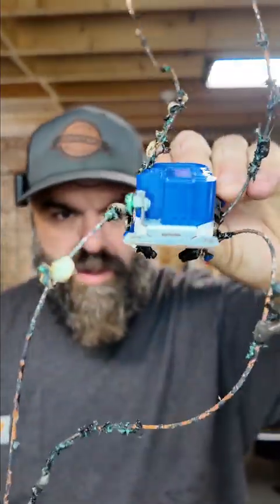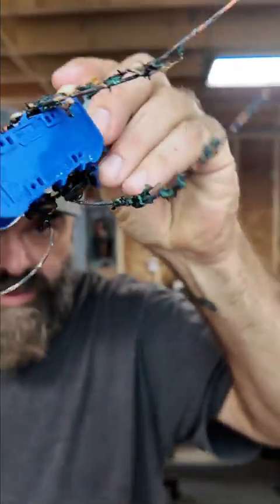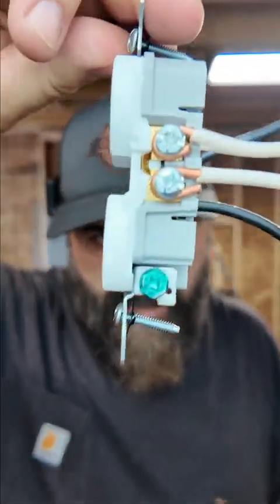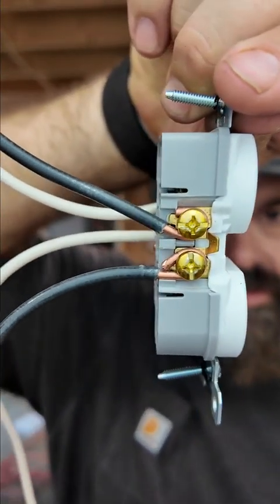But if you look at my other experiments — this is 14-gauge on hooks, and this is what hooks did in the same experiment. It's the 14-gauge that is the issue, because this is 14-gauge on hooks, same experiment. This is 10-gauge on hooks in the same experiment. I believe the heat is coming from the resistance of the conductor. The conductors have enough resistance at 90 amps to generate enough watts to melt the plastic. Thank you very much.